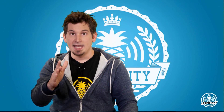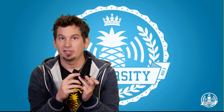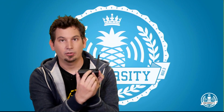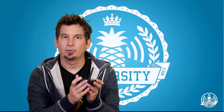Now, boot modes — these are huge. The five dip switches on the right side of the device allow you to customize what the pineapple does without having to log into the web interface. From left to right we have switches one through five. Switch number one and switch number five — the very leftmost and rightmost — are reserved for system functions. The three in the middle are absolutely configurable by you.